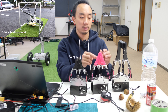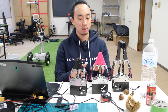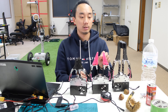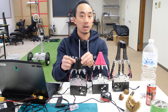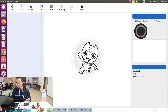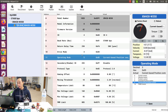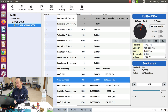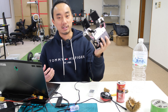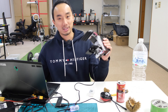We can redesign and modify stuff on this gripper to match your object and whatever task you want to do. For example, I'm going to use TPU material for a soft grip instead of the solid carbon plate. Let's test with the short length gripper first. I'm going to use my own arm instead of a robot arm because I want to test just the gripper without making it complicated.